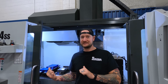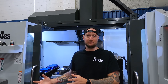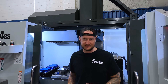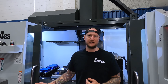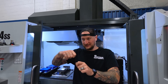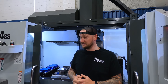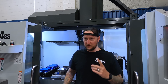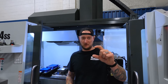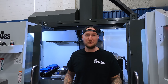In my experience using this, it's 100% true. When it comes to putting vises on the table, it not only holds them down very effectively — we've done some very heavy cuts and very aggressive milling with no lift, which was a concern. You're tightening a little tiny set screw and it holds everything in. You kind of have doubts, but we've had nothing lift. The only time we had something lift was when we put the wrong shank in the wrong hole — three-quarter inch versus inch and a half. If you're not paying attention, that's on you.